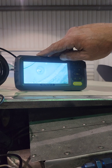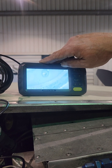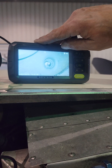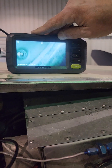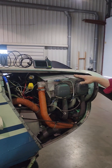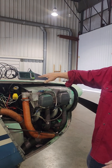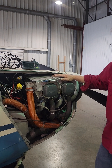Actually, looks like we have a little problem up there that I didn't see until just now. You can see there's an extra little bit of material up there — it shouldn't be up there by that plug. So that plug is going to need to be removed and replaced as well. In that process, I'm actually replacing all the plugs. The top plugs are a little harder to replace because I have to remove all the shielding and the top cover, which I'm not likely going to be able to do today, but I'll definitely do that before we try to fly it.